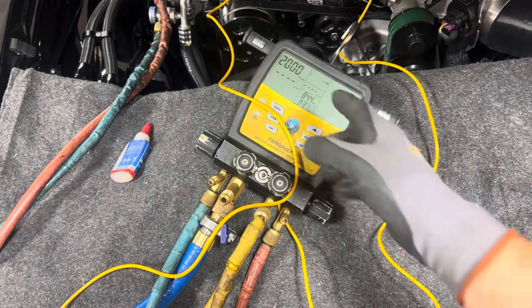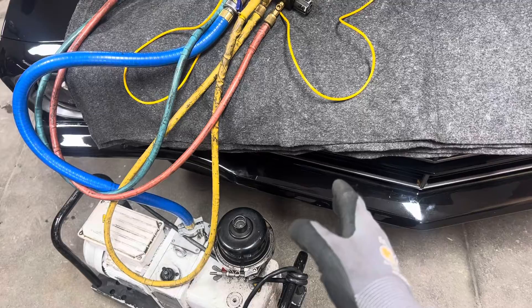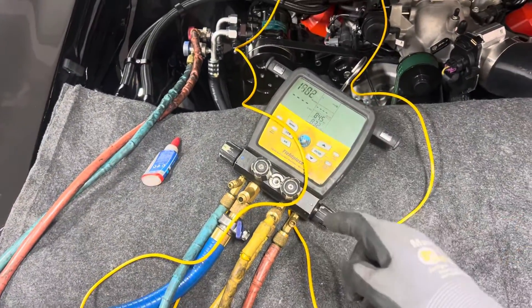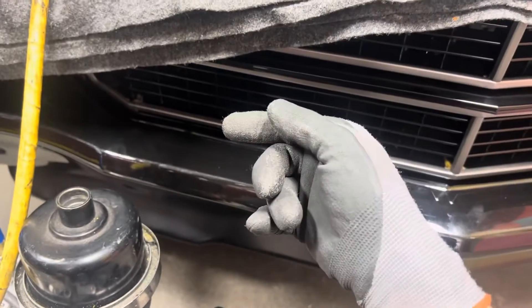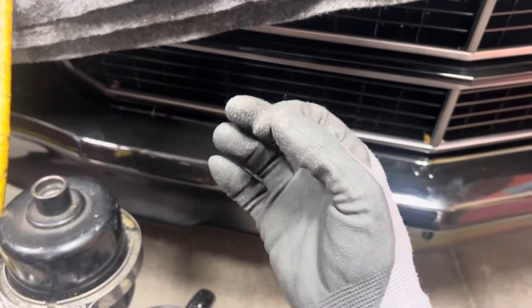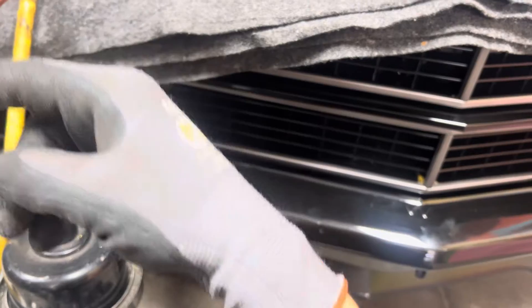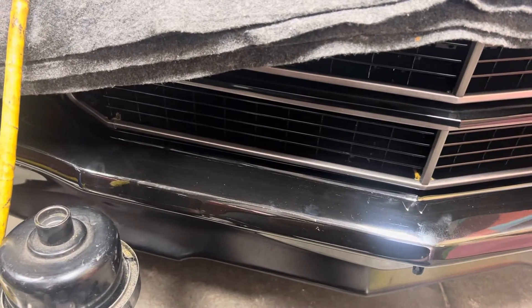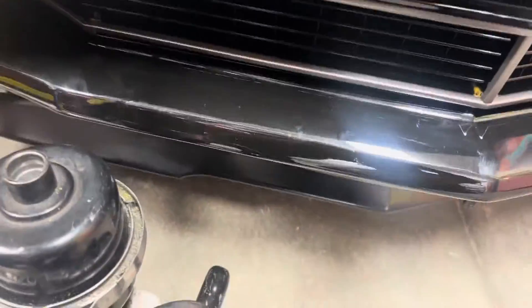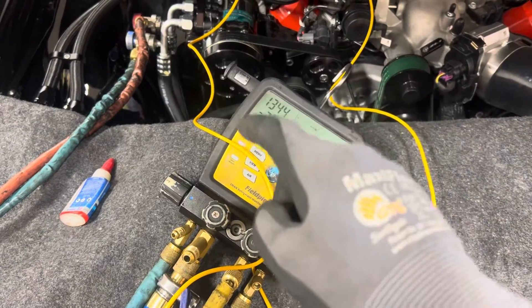Okay, it's going back down — it's settling out. Maybe it's okay. So what I'm going to do, because I know they brazed, they welded, they did TIG welding on the condenser — I'm going to throw high-pressure nitrogen in here and do a high-pressure leak decay test, because they painted over their brazing. Just by painting a weld, the thin coat of paint would be like an epoxy sealant and it could stop a leak under vacuum. But when you put pressure under it, it could leak later on — and even not just pressure, but the pulsation, vibration, and hot refrigerant gas. It might not leak for 5 or 10 minutes or a few days later, and then the tiny little leak will pop the film of paint out of the way from a bad weld. So I might not even find a leak today because it's painted over where they welded. Next video: high-pressure nitrogen decay test.